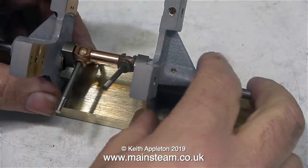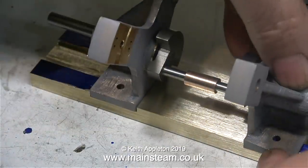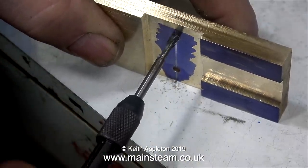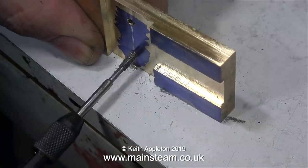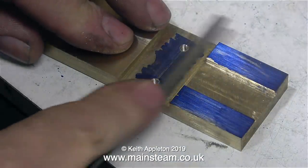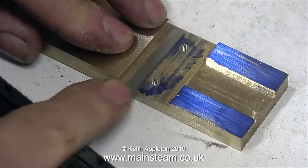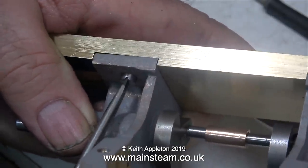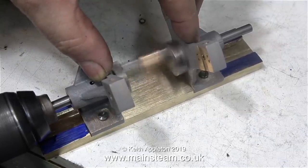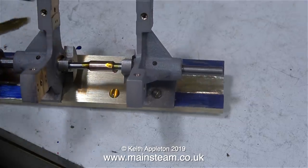In this clip you can see what the phosphor bronze sleeve is for. Before I can test the engine I need to bolt it down onto the base. I originally planned to use 2BA bolts from underneath, but when I looked at the engine I realised 4BA bolts will be perfectly adequate, so I've drilled and I'm now tapping the holes to take 4BA bolts. To prevent the engine not sitting flat to the base I'm deburring it using a needle file. The fastenings are some cheese head 4BA bolts, and when I connect my old DeWalt battery drill to the crankshaft it seems to rotate okay. Time to oil the parts — both the sleeve in the middle and the two oil holes on the castings.